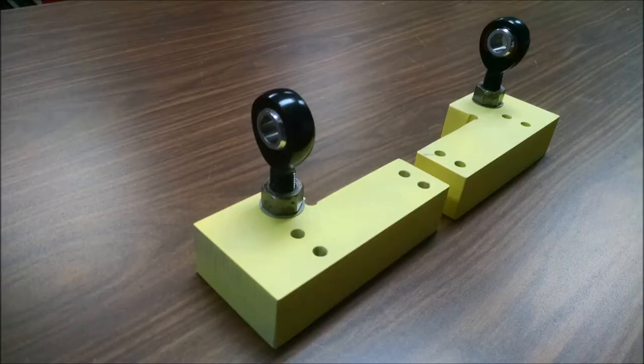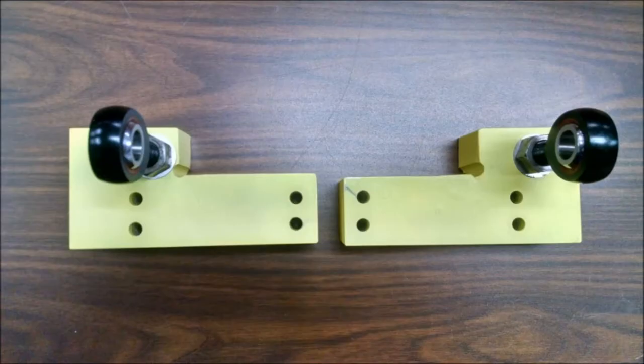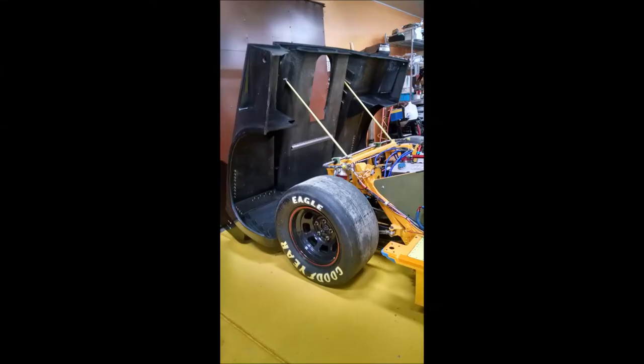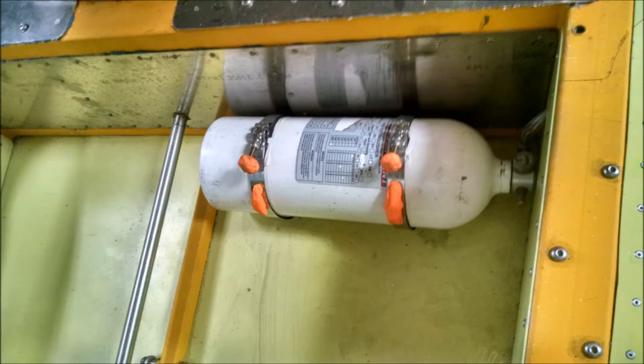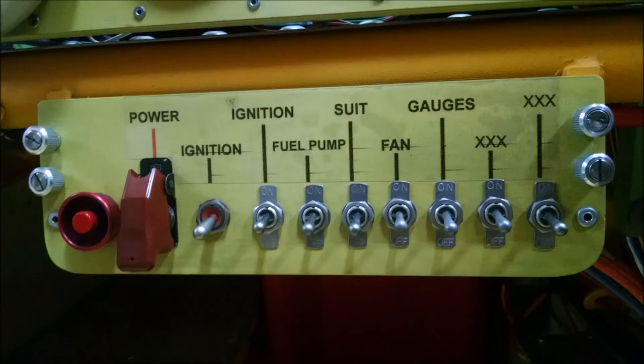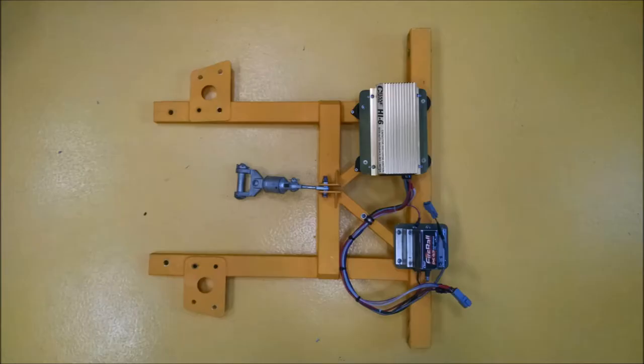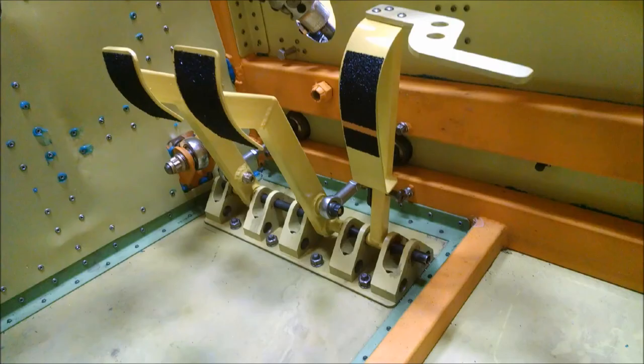I made brackets to raise and lower the rear bodywork, with quick-release pins through the rear section and solid stays to hold the bodywork up — I prefer solid stays over cables because the first time the wind smacks a cable-held door down on the back of your head, it's no fun. This is the rear firewall and the automatic extinguisher. I used a switch guard on the master electrical so in case of emergency you just bat it down with your gloved hand and everything goes off. The brace across the top of the rear chassis is where the ignition system and coil are mounted, as well as the parachute swivel.